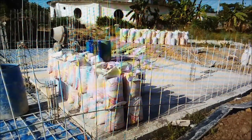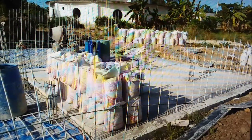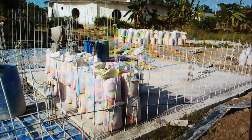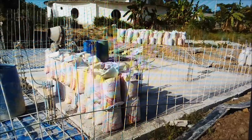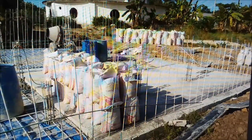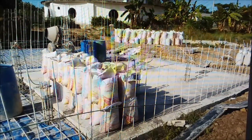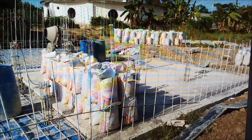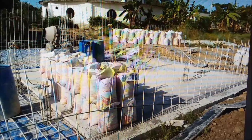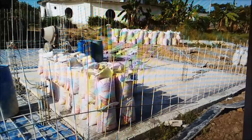When we did some work inside we put some foil-faced white foam insulation — the kind used under ceilings — to seal it. The other reason was there was going to be something poured over top, and it would have bound the forms so we couldn't get them out without beating the crap out of them. I think I still have that foam, so when I go to do this I might just have them put half-inch white foam and staple it onto the bottom of the form to line up on the inside edge.